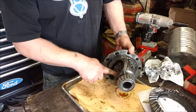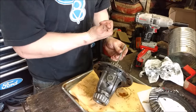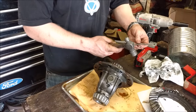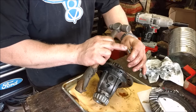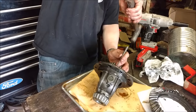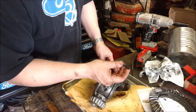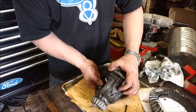Now we have to remove this large pin in the center, which is retained with a roll pin. I have a roll pin tool set — this has been one of the neatest tools I've ever bought. I'll put a link below; they came with a nice wood case and are made by Tekton. The tip has a little dome and flat edge so it centers itself in the roll pin and doesn't mushroom it out, making removal and installation effortless. The roll pin is actually reusable this way.